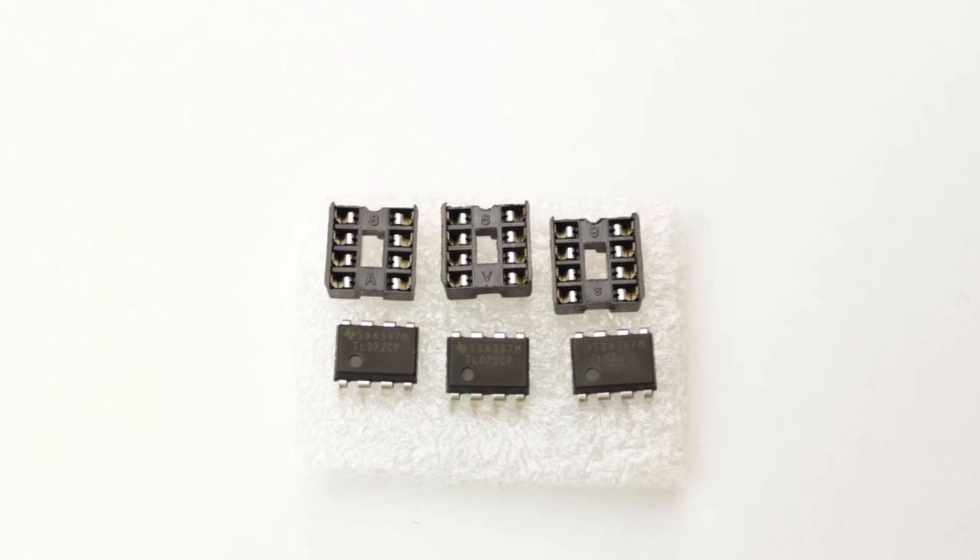So far we have looked at individual or discrete components. However, thanks to the evolution of microtechnology, we now have at our disposal what are called integrated circuits. An integrated circuit, or IC, is a complete circuit made up of various miniature components encapsulated within a package, with its legs giving us access to different parts of the circuit. ICs can be analog, digital, or a mix of both, and usually require a ground and power connection. They will usually be designed for a specific purpose, such as amplification, logic operation, switching, or timing — and there are even digital potentiometer ICs. It's usually good practice to solder an IC socket rather than the IC itself, as this protects the delicate internal components from heat damage and makes replacing ICs much easier.